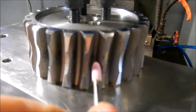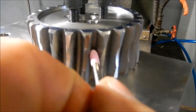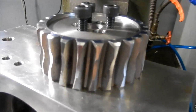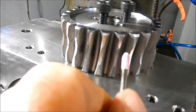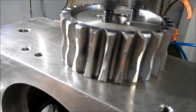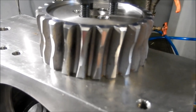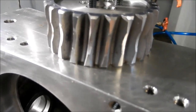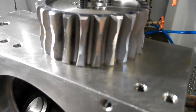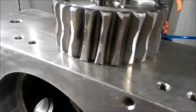So what I'll do first of all, before I do any work cutting the flanks on that, I'm just going to get in there and clean up inside, to remove all those machine burrs that are on that face. It's really badly galled from the machine that was done on it. So I'm going to spend some time out in the sun with my Dremel, and I'll just very, very gently clean that surface up, and then we'll come back and try it again. And if we're still having issues, then we'll set the lathe up for that 2.5 module cut and just lick those flanks on one side.